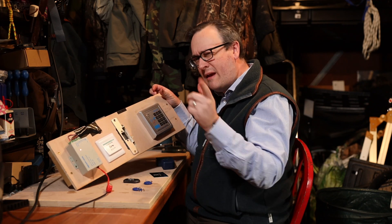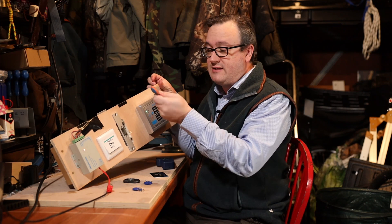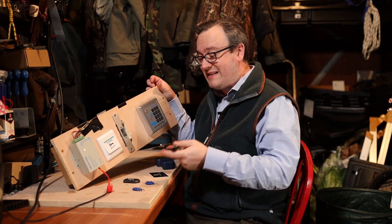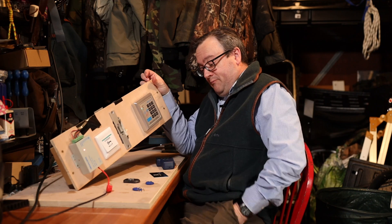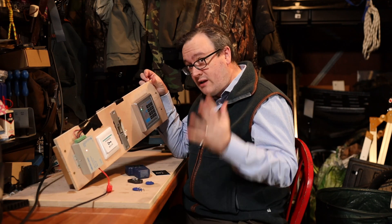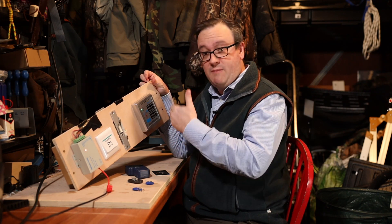Before any of you think no one's going to use those kind of tokens in the real world — let me get my keys out. What I want to show is this little thing on top, which is essentially just a bog-standard low frequency RFID token, exactly the same as the ones I've shown. You can use one of these readers or a Keysys to replicate my alarm system — and this is a relatively modern alarm system. Any RFID system that bases its authentication purely on the serial number of the token is fatally flawed and can be copied.